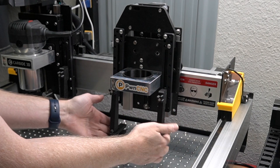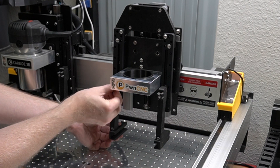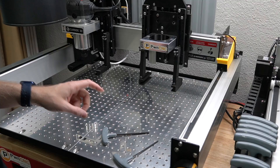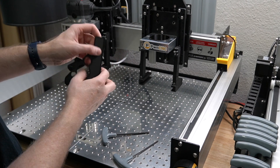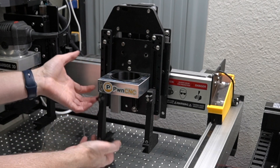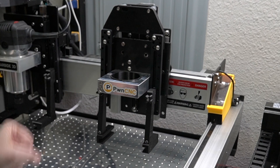The simple thing is to make sure these are at the same level. Use these holes as a guide — if you tighten one side to the third hole up, tighten the other side to the third hole up also, then insert your boot. You can run a metal file on the inside of those L-shaped pieces right here if you find they're way too stiff to move up and down. They are expected to be stiff at first — as you use it, that will become easier. Don't be alarmed; just use that file to speed it up.